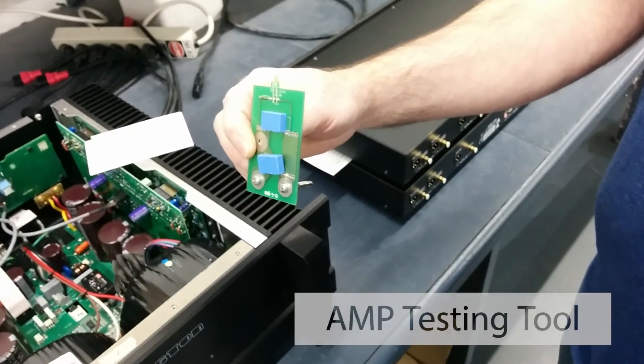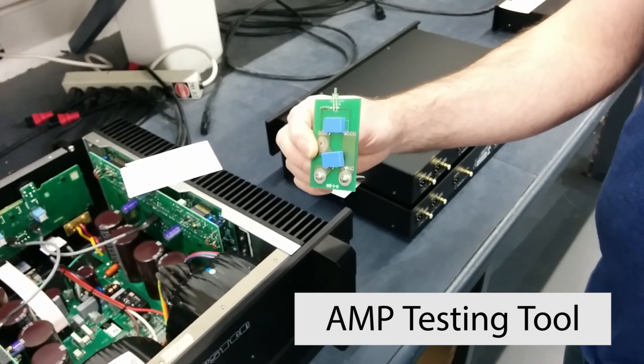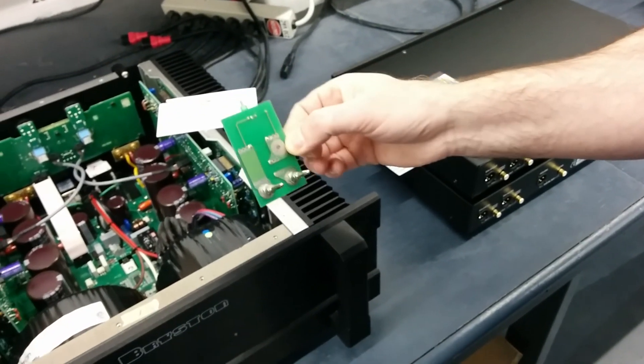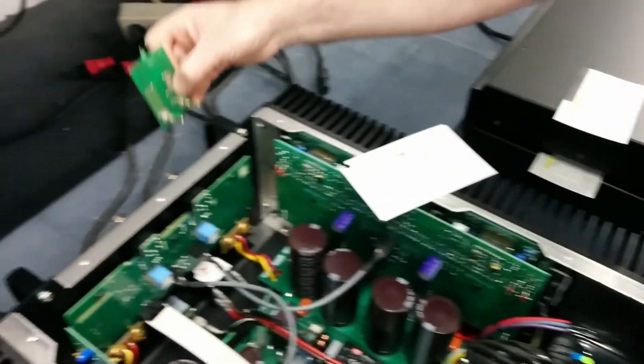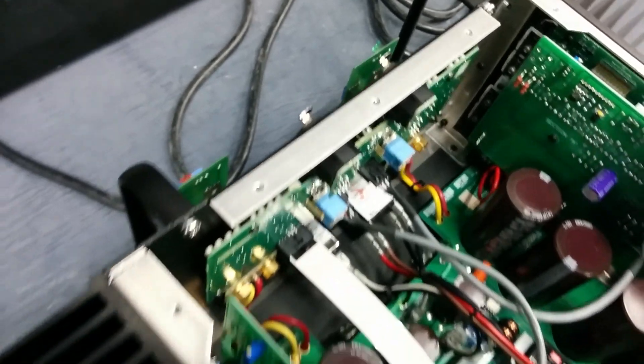So the amp drives a square wave at three kilohertz into a capacitive load, which reflects all the power back into the amplifier. Can you turn that around? This thing plugs into the back of the terminal for the speaker output — yep, that's right. And this is the speaker output, and it's basically for burn-in.